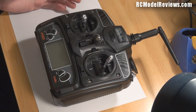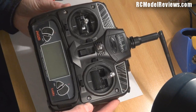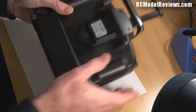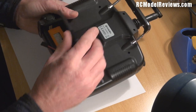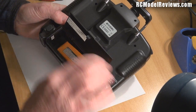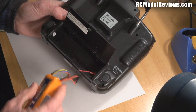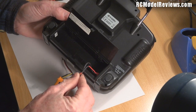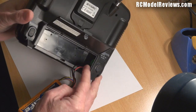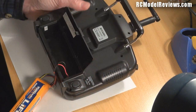I've cleared a little space on my desk and we're going to take this Walkera Devo 4 radio, pull it apart and see what's inside it. This one's already been converted to LiFe batteries - I've got the HobbyKing 1500 milliamp LiFe battery pack. To install that I cut the wires and soldered on the JST connector they use, but it's damn hard to get out of this little compartment.